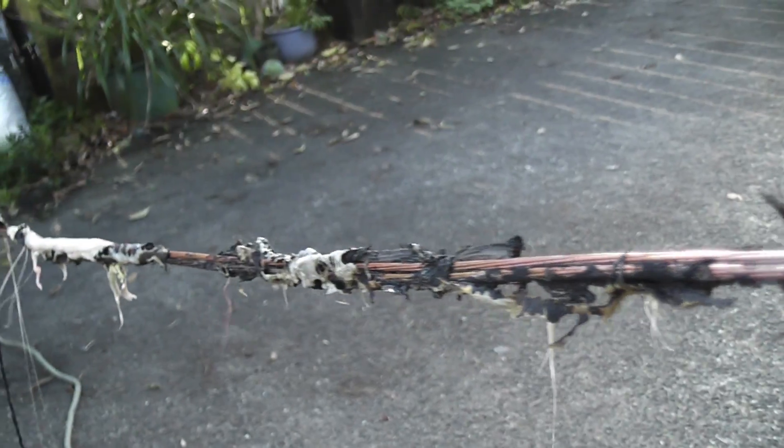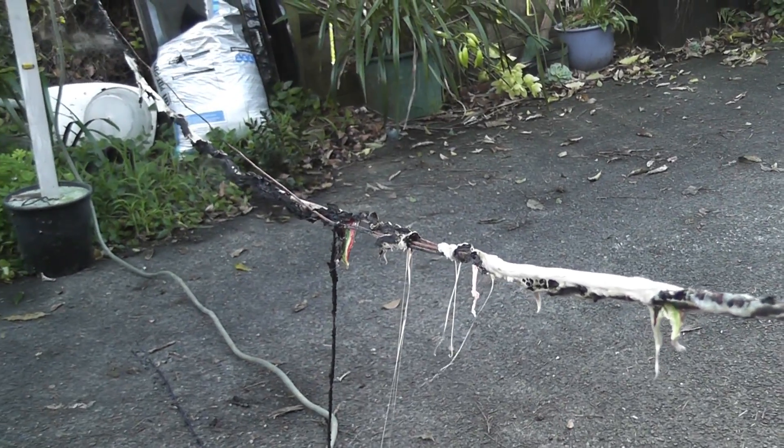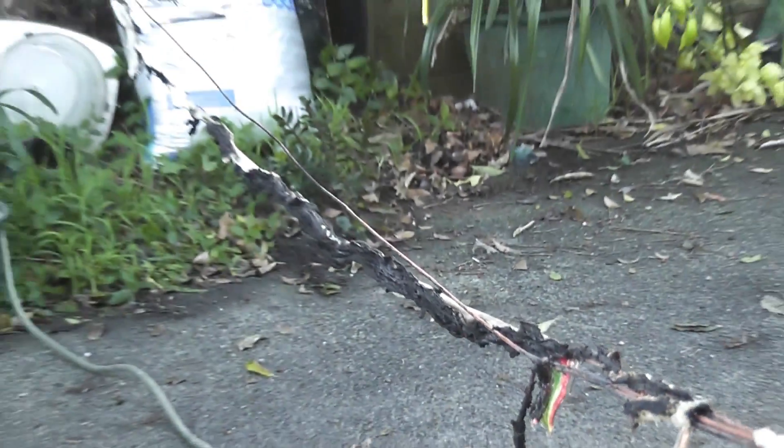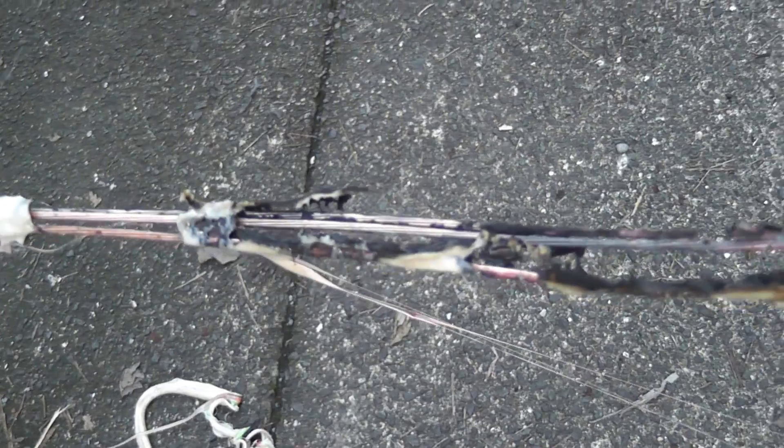So I'll get another piece of cable. I may use a twin conductor for this particular one. It's definitely the way to strip cables if you have to. Look at the colors there — green, blue. Quite a bit of heat generated in this stuff here, it's just unbelievable. I'm just analyzing the situation. It's probably when the plastic melts off, having three conductors in the cable, you get a short somewhere, you get a hot spot, and that's what has deteriorated the actual cable.